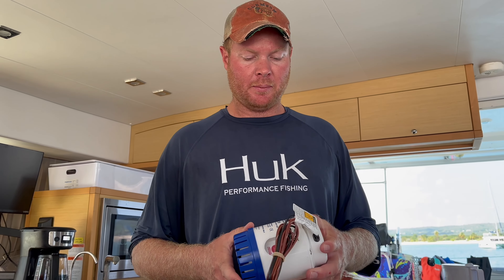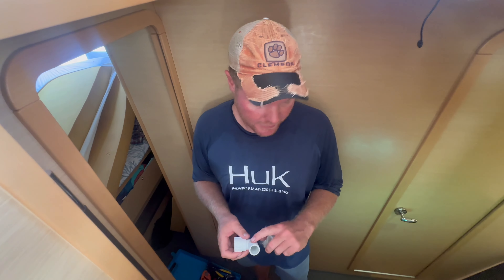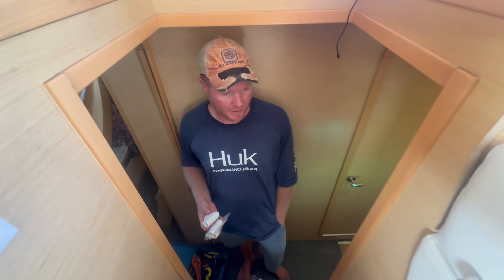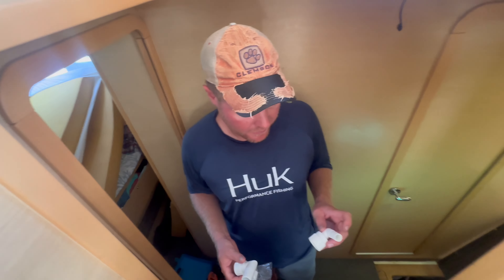Just got the water maker finished rebuilding it. I've got these 2000 gallon per hour bilge pumps I'm going to upgrade to — about to start installing those. The bilge pump came with one-inch and one-and-one-eighth-inch fittings straight, but the 90-degree fitting only comes in one-and-one-eighth, and the hose down here is 25 millimeters which is just under an inch. So it's too big — I don't have a transition piece to change one-and-one-eighth to one inch. I always need more parts. I might be able to clamp the hoses for the time being until I can get what I need.